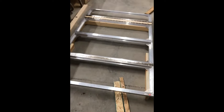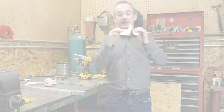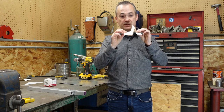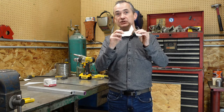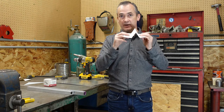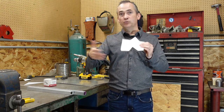This creates a bed and then the reverse to put it back together. And then I just folded it flat to figure out how much distance it has when it folds down starting from here where do the two by fours meet all the way flat how far is that ended up being 28 inches so then I needed a 28 inch drawer slide rated up to 500 pounds and Christine and I can both be on that without going past the weight rating.